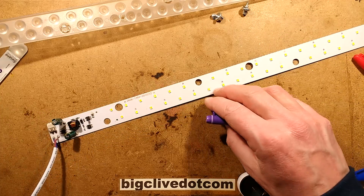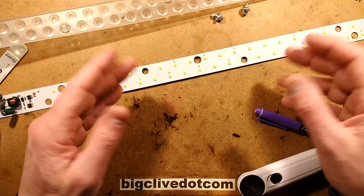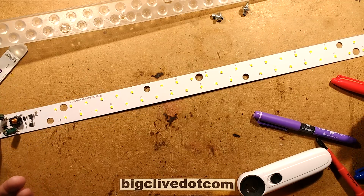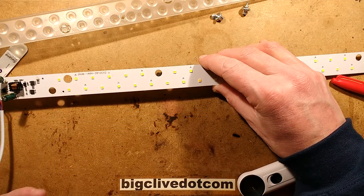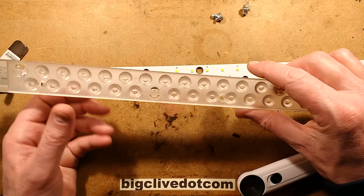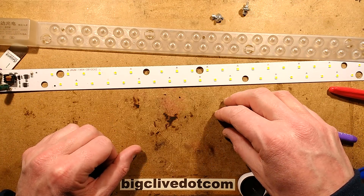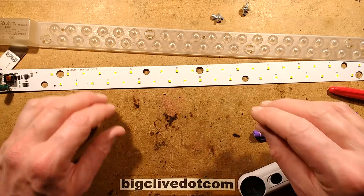If you run your fingers across the back of this isolated plate you get a slight fuzzing — it's not live, it's just capacitive coupling from the live tracks on this side through that thin layer of fibreglass that separates it from the aluminium substrate at the back plate. So it's quite interesting strips. I'm guessing it's just a general replacement strip for where you might have a 13 watt 21-inch fluorescent T5 tube, or perhaps just designed as a stackable array of LEDs for lighting sound panels. It's quite smart, and once again it is fully insulated by this plastic cover that goes over it. Yeah, it's quite neat — I quite like that.